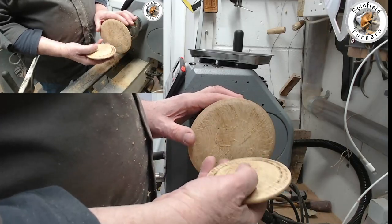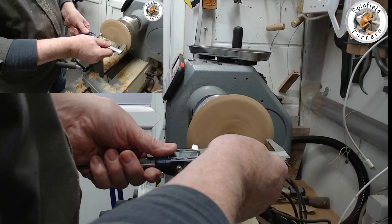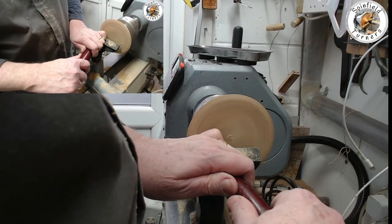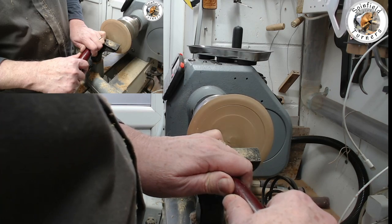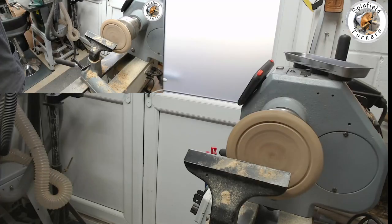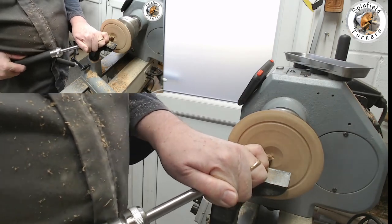With the top parted off, I just measure the external diameter of the lid and transfer that to the base — the intention is the lid sits inside on a little ledge. Making sure when you mark it that you only put the leading edge tip on the wood, otherwise it gets very exciting very quickly. Now reinforcing that mark with the point tool and then starting to shape the inside using the 3/8 bowl gouge to start profiling.